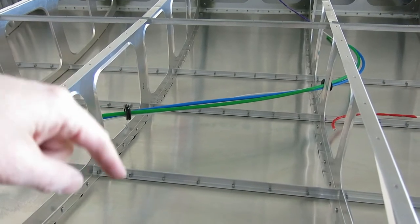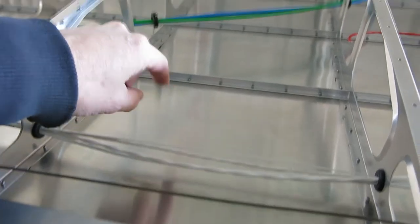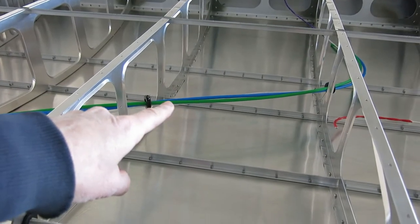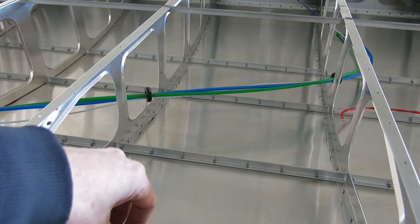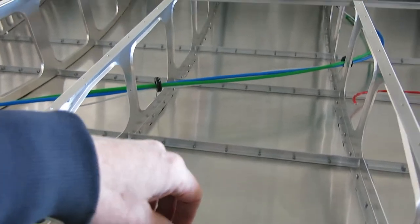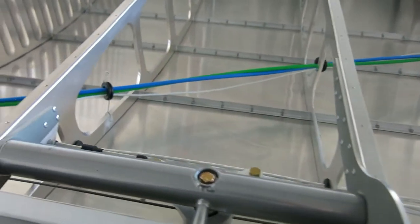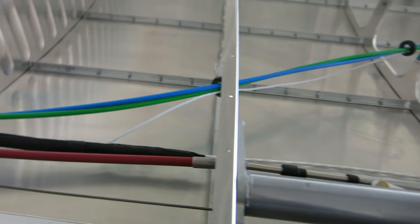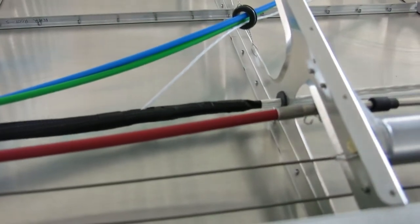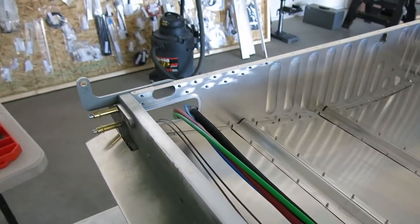for that. I didn't want to run the pitot heat wiring alongside the tubing for the pitot, just in case, I don't know, in case something should go wrong and this wire gets really, really hot. I didn't want it to damage that tubing in there. So we kept those separate, and we put it into the loom here and then out through that. Okay.